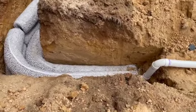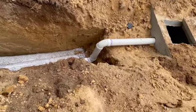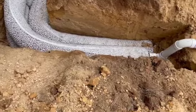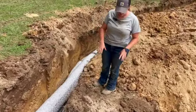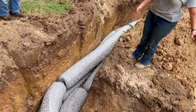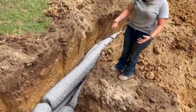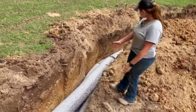Okay, so this is going to be your outlet side. It's 2 inches lower than your inlet, so it's going to let some water release. I 90'd it down and 90'd it into your Easy Flow. Your Easy Flow is going to be in 10-foot sections, so you've got 2 bottom pieces and a top piece, and the top piece connects, and as the water comes out, it allows it to drip through the pipe onto the Easy Flow. It'll absorb some through the Easy Flow, and then it'll go down to your ground, which is beautiful dirt, so it'll absorb in there, and it's 80 feet long.